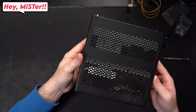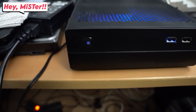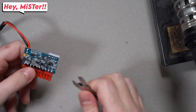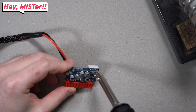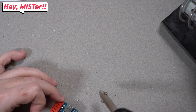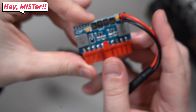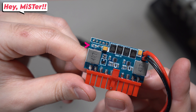Next test — and fail again. Do you see the blue light? It even comes out of the front USB. That's the Pico power supply unit, which has a small but very bright blue LED that is way too bright even in standby. So I figured I had to desolder the LED. In order to get to it, I even had to remove the posts for the additional power, and then I removed that LED.